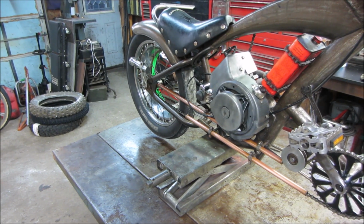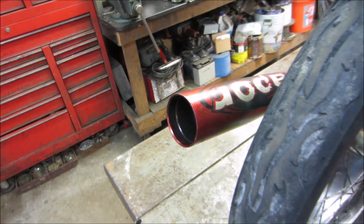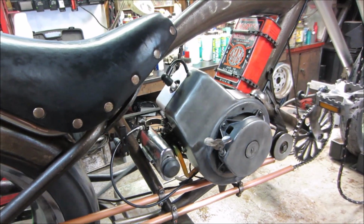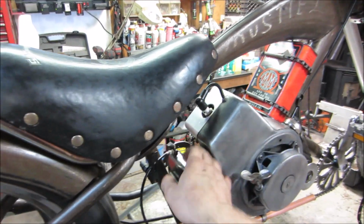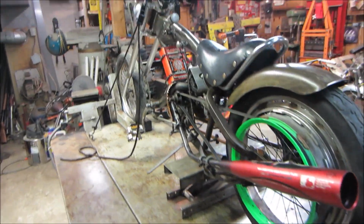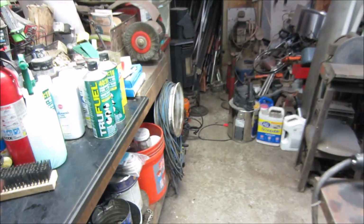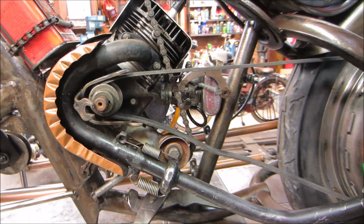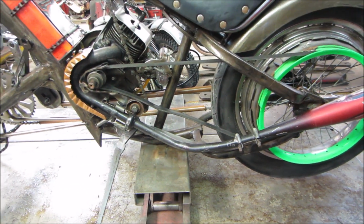I'm trying to keep it running, I want to go at idle. Turn the choke off and give her a few revs. That's cool. Again, that was the true fuel. Got no ethanol in it, so it survived. Good, we don't have to tear that carb apart. Figures, because I fired up the ultrasonic cleaner and it's all warm, ready for the carb.